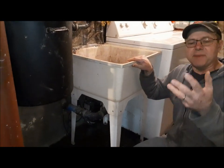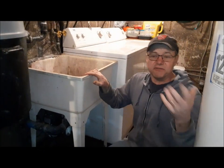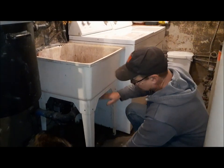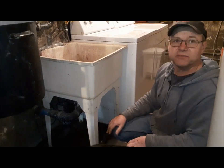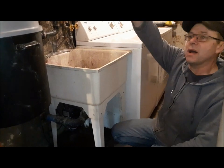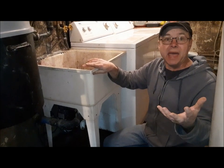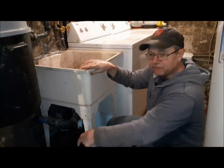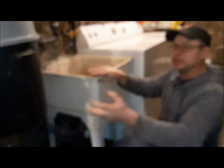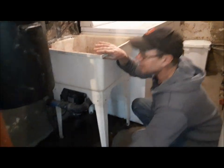You've basically got about three different choices. One is if you've got a bathroom down here, you can buy a toilet with a sludge pump built into the back so you don't have to smash the floor, and you could run the drain into that to pump it up to the septic. The other solution is a sludge pit with a sludge pump inside it in the floor — you could dump the toilet, the washing machine, all that stuff into it and an effluent pump would pump it up.